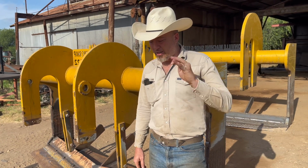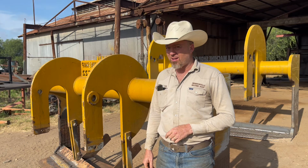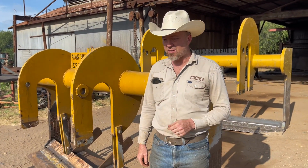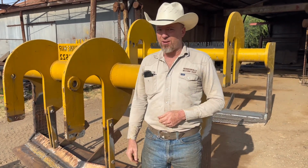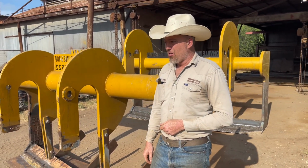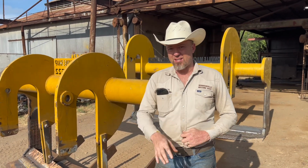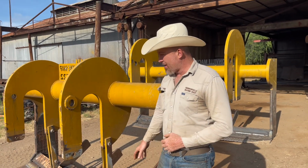I tell everyone, if you're gonna really get into it and you really want to root plow with a Caterpillar and make money, you need a D7 or bigger, okay? Because the D6, while I think it has more power, will not out root plow a John Deere 850, okay? And I know this from years of experience, years of watching. You will always outplow anybody with a John Deere 850 versus a D6 of any model. Okay, so keep that in mind.